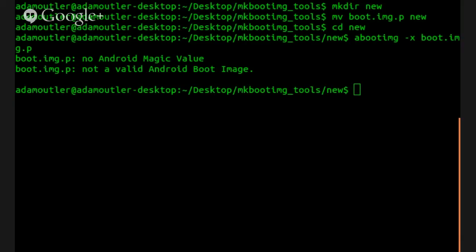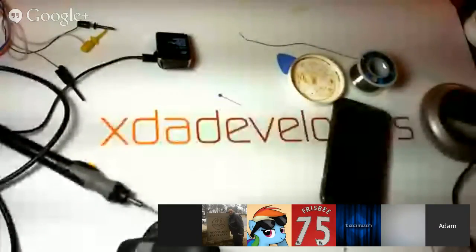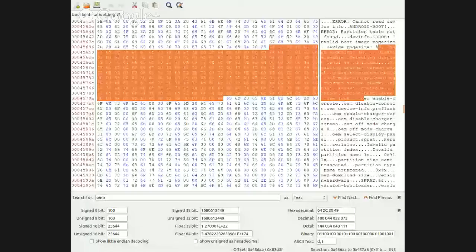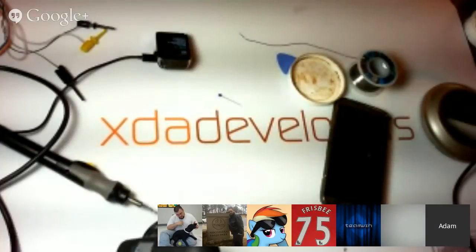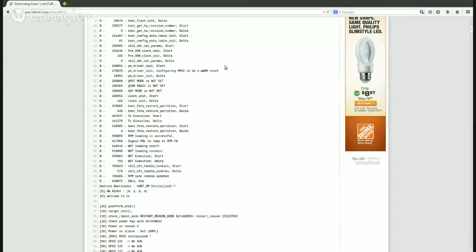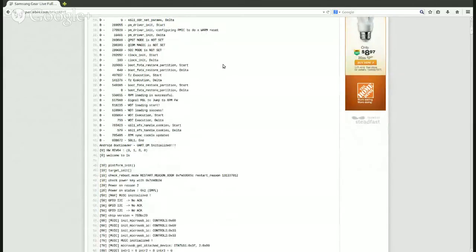What do you know about DTB? There are different acronyms used for it, but most people I've seen call it device tree blob. The eventual goal is to get you to a point where you can use the same kernel source across multiple devices, and all the device-specific stuff for things like the panel and the touchscreen goes in the device tree part, so that a manufacturer would hopefully only have to patch one set of kernel source for all their devices instead of keeping separate repositories for each.